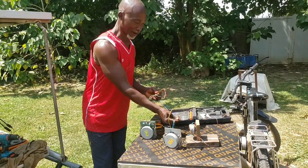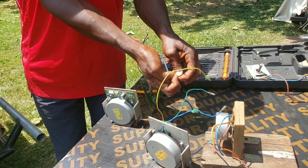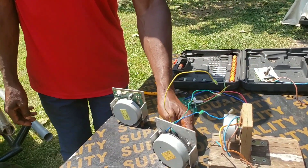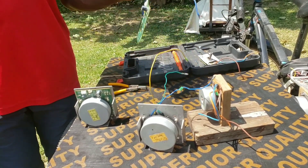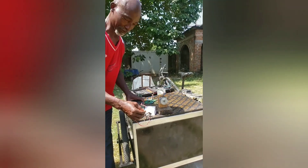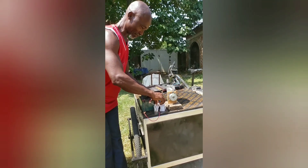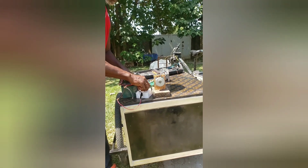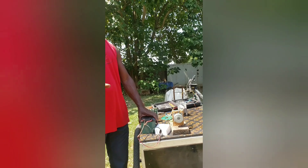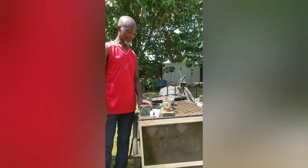You can just place it like this and use the controller to drive it, then we can also check it as a generator later and see the power output after configuring it — the power as a generator and the power as a motor. Now I'm going to get a speed controller to drive it as a motor. I've connected the phases to the controller and I'm using the potentiometer to control it. After modifying it, this is how it runs. This is 12 volts and 24 volts at the BLDC. If a fan blade were connected to it like this, it would blow you.